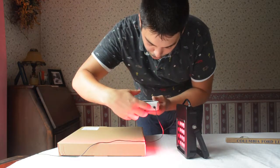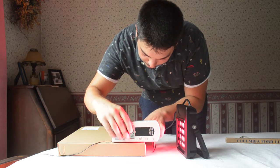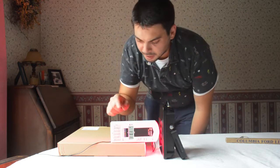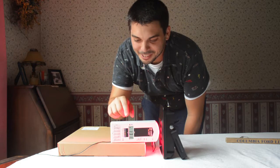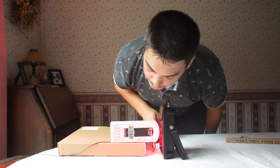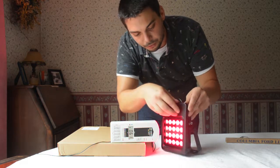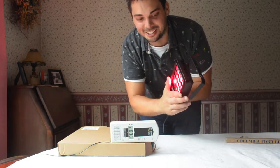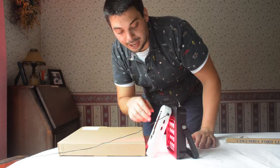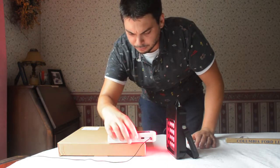With the magnetic field, I do notice a little bit higher on this particular unit — it bumps up to 131 nano Tesla. In a previous YouTube video I did the conversion wrong: this is in nano Tesla, which you divide by 100 to get milligauss, so this is 1.3 milligauss. You get a little bit more because it's 20 watts packed into one small unit. If you bring it right up on the power driver, you get closer to 3 milligauss. Check the website for the latest data.